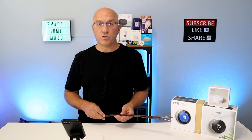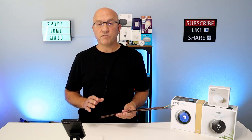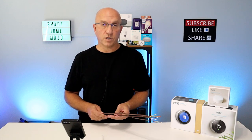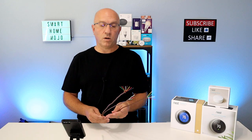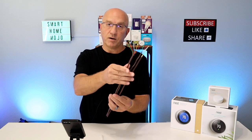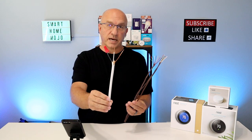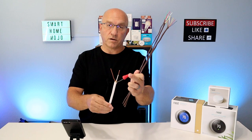The good news is about 95% of all homes run off of 24-volt heating and cooling systems — low-voltage wires — and we'll give you a close-up of these wires in a minute. What you're looking for when you take it off the wall is small wiring wrapped in a brown covering, as opposed to high-voltage wires with red or colored wire nuts.